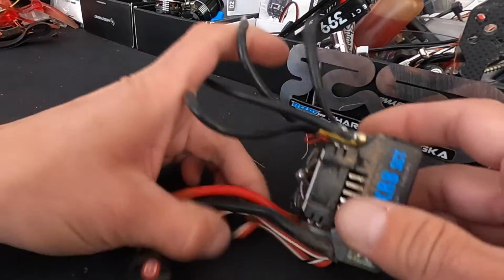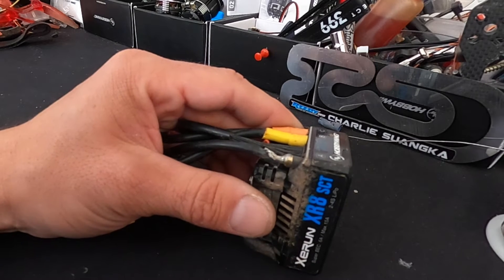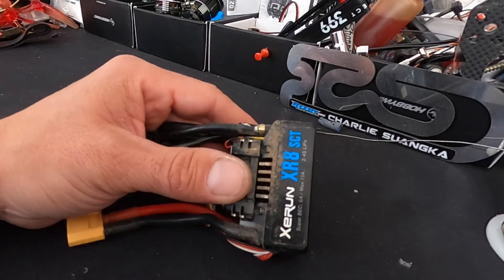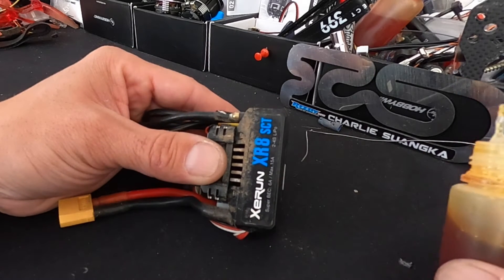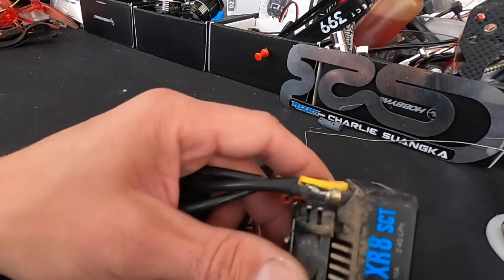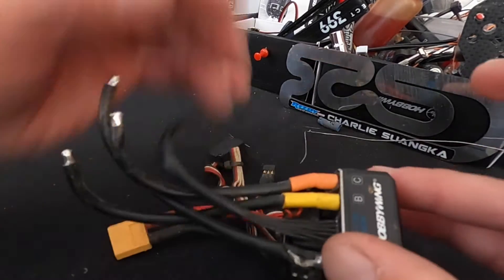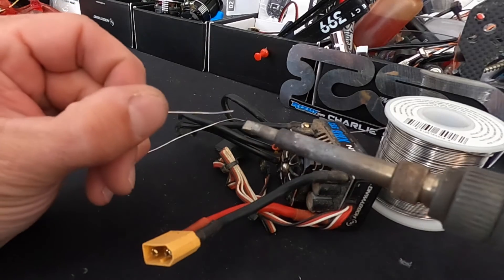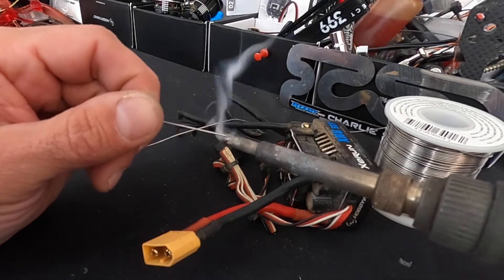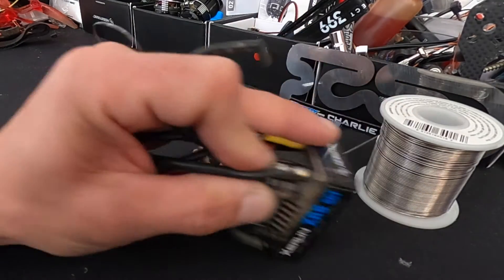The only real trick I have for removing wires is: if it doesn't go, you want to have some flux. I have some liquid flux — it's a rosin flux; there's paste and all sorts of stuff, and that just cleans things up. These are under shrink wrap so they're pretty clean already. I like to always hit the iron with some fresh solder right before I start — pre-tin it. And solder, for those wondering, is spelled S-O-L-D-E-R, just like aluminum is spelled aluminum, not aluminium.